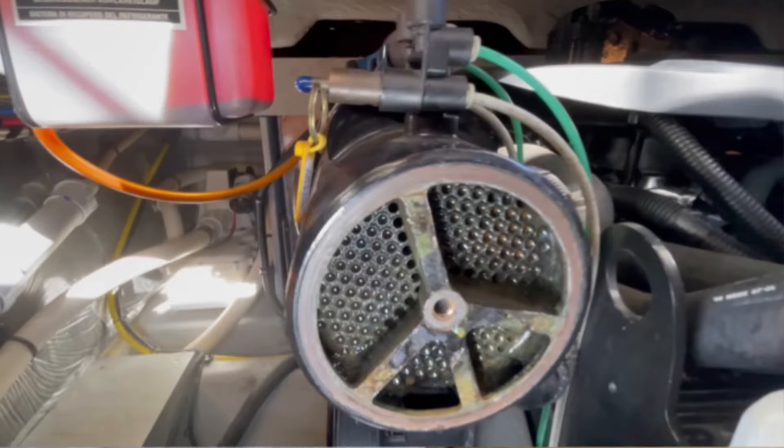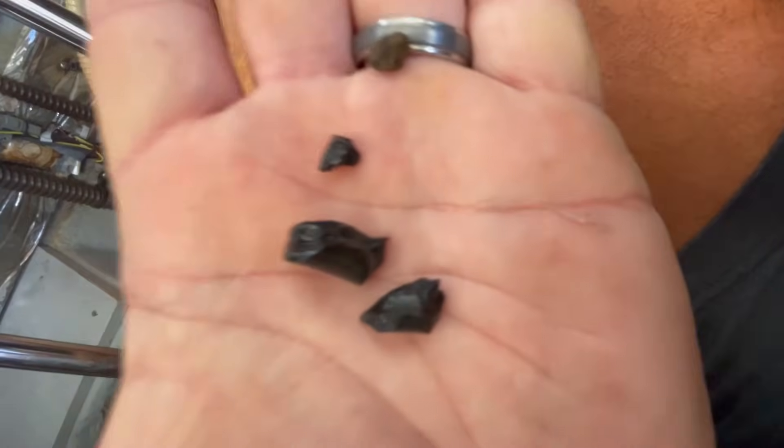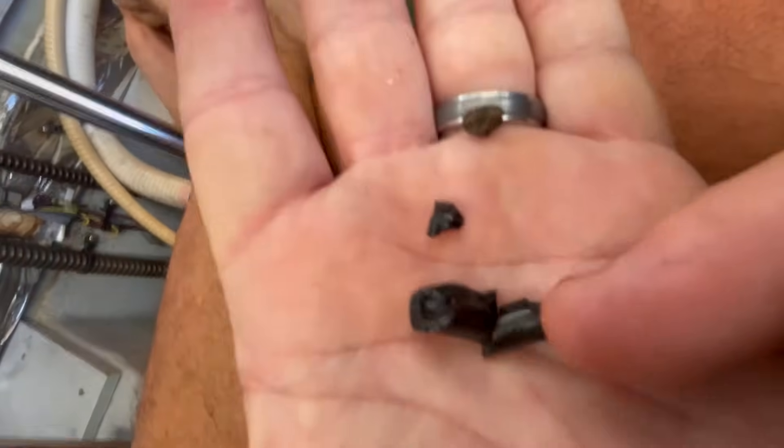So that's it — just some basic checks to see if your raw water intake system is clogged. It should be checked every so often, especially if you've had issues with your impeller, as you can see the chunks of rubber that get stuck inside the coolers. We haven't overheated since we changed the thermostat, so that was likely the issue — I probably had a bad thermostat. But it's always good to flush everything through. We've got a big trip coming up soon — keep your fingers crossed. Thanks for watching, we'll see you next time.